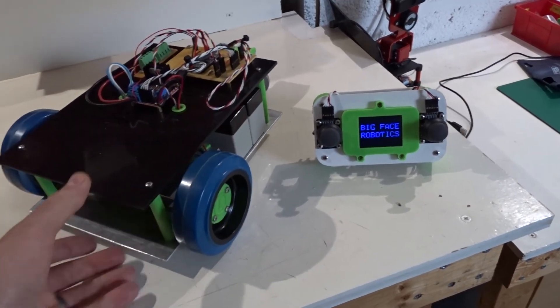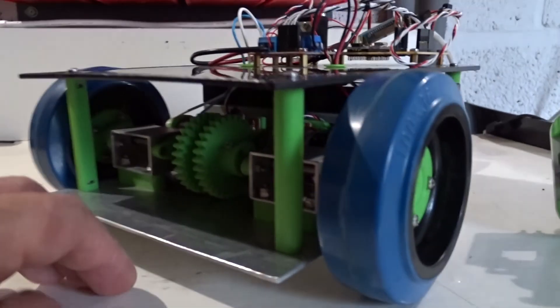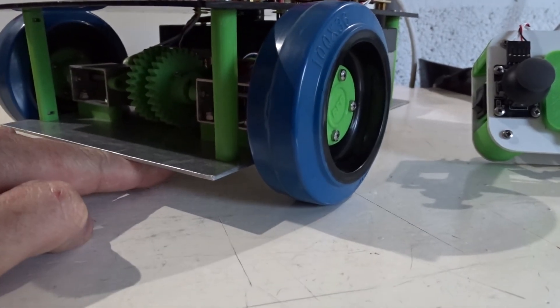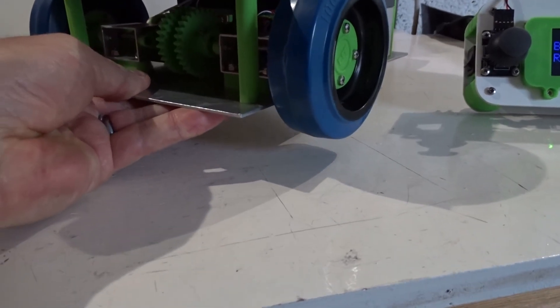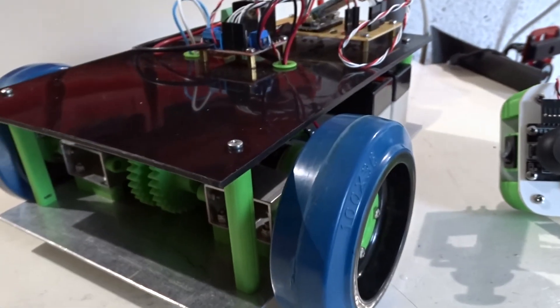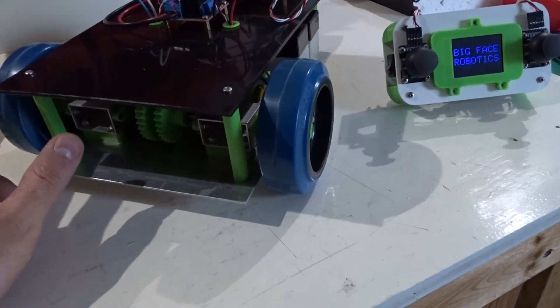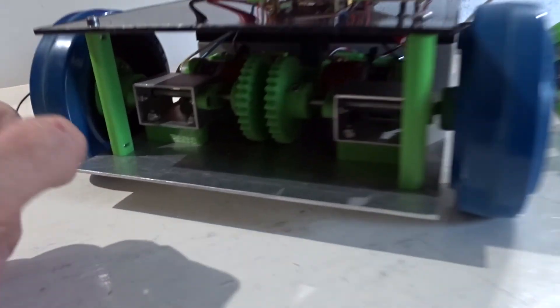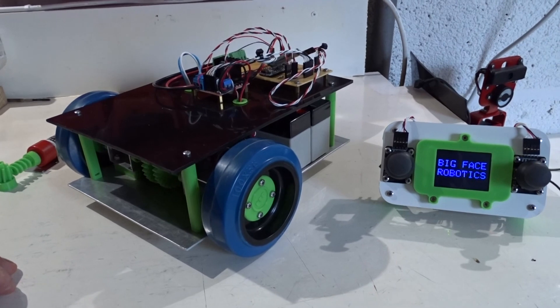When trying to drive down hills or on uneven ground, the fact you can back-drive the wheels very easily, combined with the weight of the robot, tends to send it veering off course. The ground clearance is also something I was hoping would be a bit higher — for driving off-road on grass and other surfaces, an extra 10 or 15mm would be perfect. So it's probably going to be a redesign of the gearboxes. I'm going to try a worm drive — not sure how well that'll go, but that'll be the next video. It'll also free up room inside so I can put the motor driver down there. As always, thanks for watching, please consider subscribing and I'll be back soon.